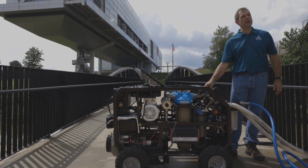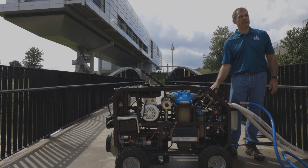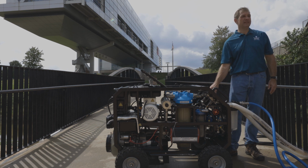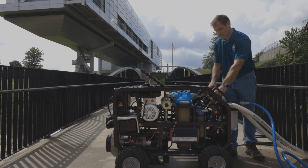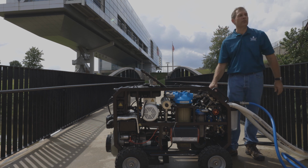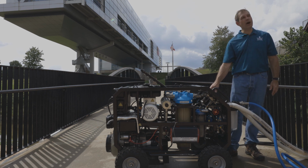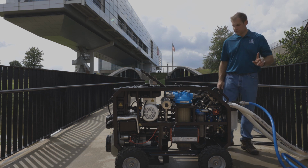And right now on our parts per million meter, we started out at about 70 parts per million in terms of the water. We're now at 20. Within less than a minute, we're at 20 parts per million. We're now at 9. We're running right at 300 PSI for the RO mode. And right now we're at 1.6 parts per million. The water's coming through the machine. So if you bear with me just a minute.